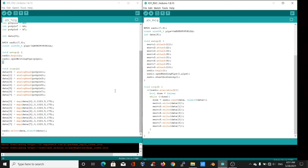In the void loop, the analog data from the potentiometers is measured and stored as variables. The values are then mapped with respect to reference values. The data is then transmitted using the write statement. The receiver continuously checks for incoming data — if data is available, it reads it and writes it to the servo pins, which controls the position of each servo motor in accordance with the received data.